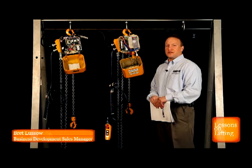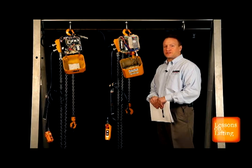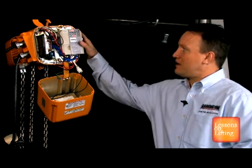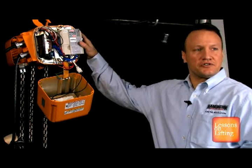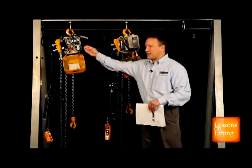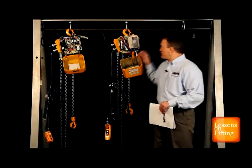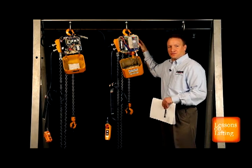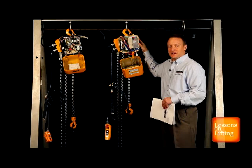The most unique characteristic is our two-speed hoist. Our two-speed is different than conventional two-speeds, in that it is obtained through the use of a variable frequency drive. This is different than a conventional hoist, which is contactor control. The beautiful thing about a variable frequency drive is the ability to adjust your speeds — not only your low speed and your high speed, but also your ramp-up time.